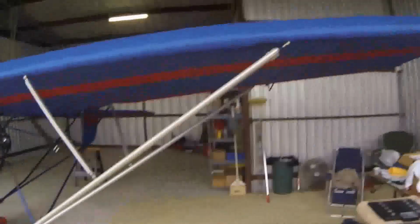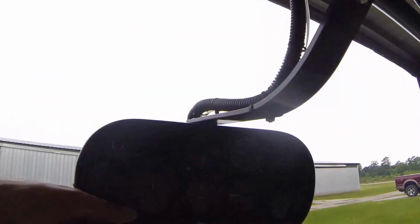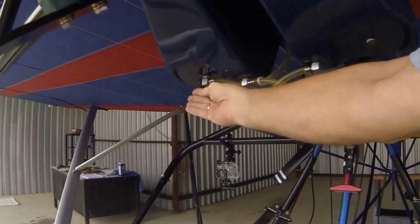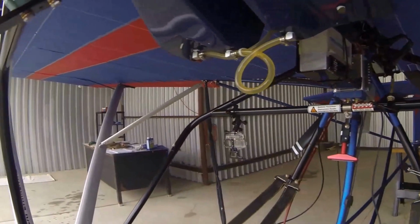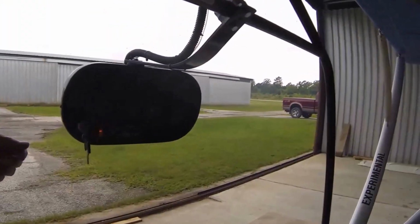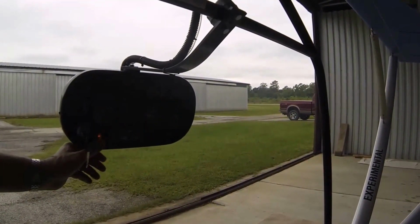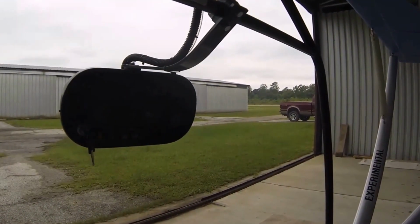And so there it is. Go ahead and shut it down. Cut the gas off first. That way it won't siphon or leak down. I mean, it has. It seems like the carburetors have good seals. Kill it, and then shut off the ignition.